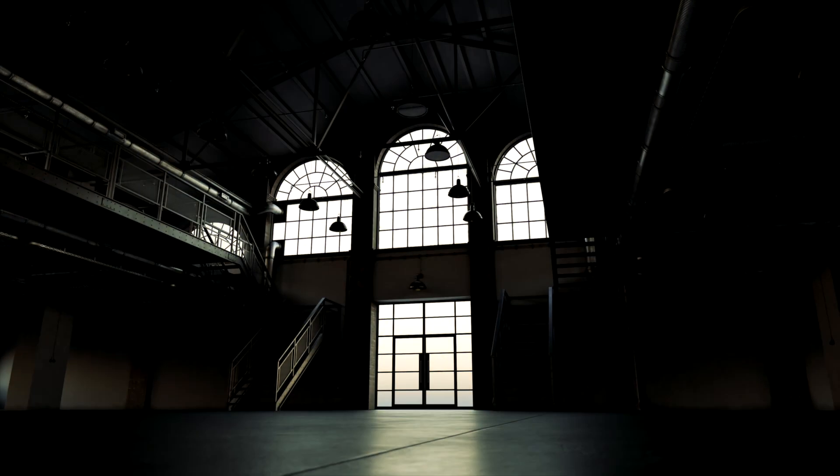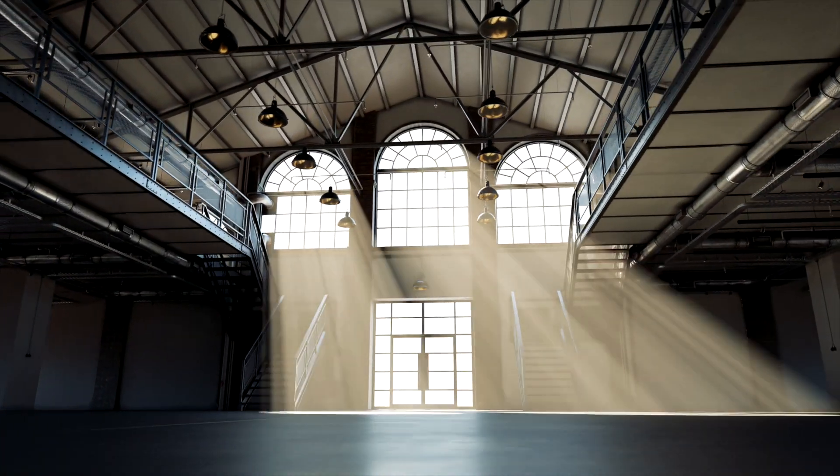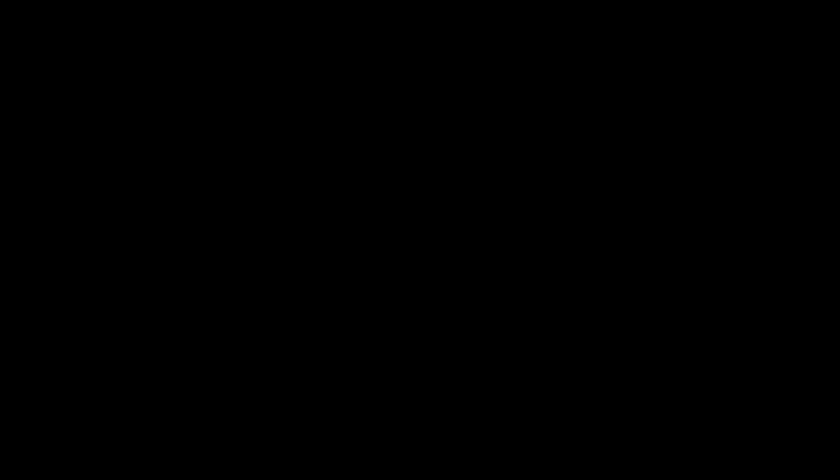The next thing to consider is lighting. Although it might not be super obvious, lighting can be extremely critical in a metrology lab. First, sunlight coming in through a window could cause the part or equipment to heat up above the ambient air temperature, throwing off measurements even when ambient readings are within spec — so keep parts and equipment out of direct sunlight. Second, lighting affects repeatability. If your lab uses non-contact measurement methods such as optical measuring machines or 3D scanners, lighting consistency is really important. For example, if someone turns on lights partway through inspecting 50 parts, a slight change in lighting conditions could cause a mis-measurement in the OMM's measurement routine.